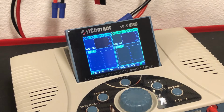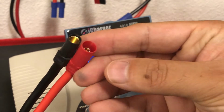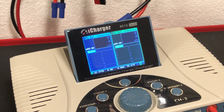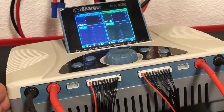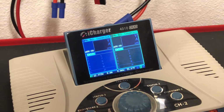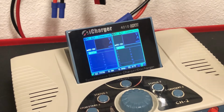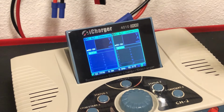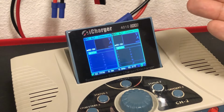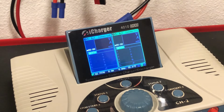Okay, so before we can use our new cable with the XT150 connector in synchronous mode, which basically means that we're utilizing both channels in the front of the charger for one battery, we have to make sure that the charger is set up for two things. Regen, because we're sending it all back to a battery input, so we need to change the power supply, and we also need to make sure that the charger is aware that we're operating in synchronous mode.